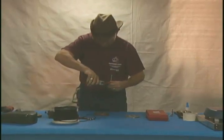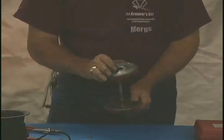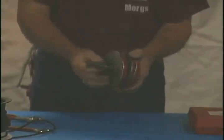We need to work on this in order to be able to get the pack back to work. We'll work our way into it, making sure that that's seated back where it needs to go. We put our lid back on it. As we assemble this back together, we slide it over the spindle and we want to make sure that on the inside we line these up so that they sit on top of the square holes aligned with each other — here is the square hole in the bottom and it goes over this square boss on the spindle part. There is our spring pack all put back together the way we need it to be.